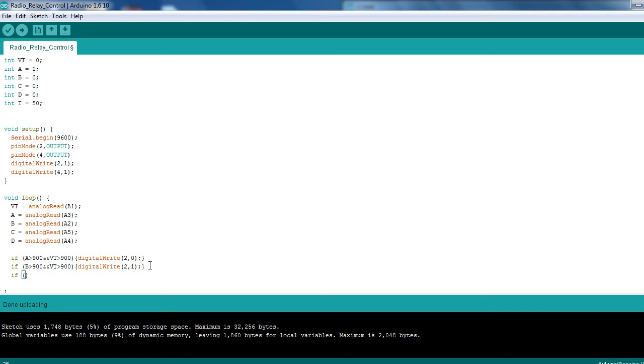Same again. So if C more than 900 and then VT more than 900, digital write, this time it's going to be 4, so digital pin 4, we're setting that low for turning it on. Oh, I forgot that. And do the same for this one also. But this time it's going to be D, so if D more than 900 and VT more than 900.